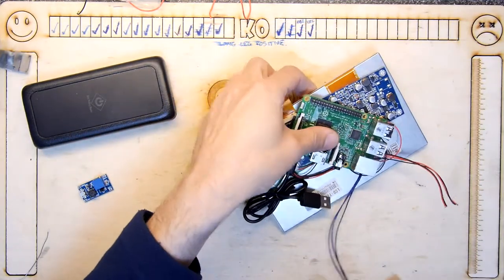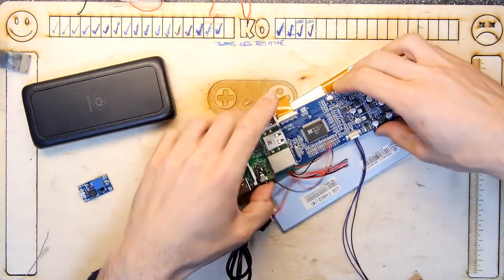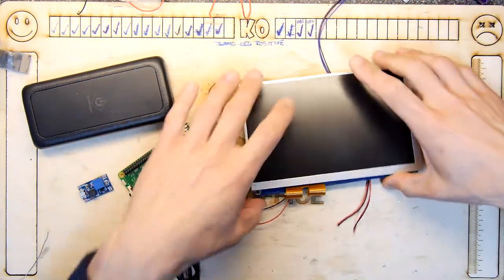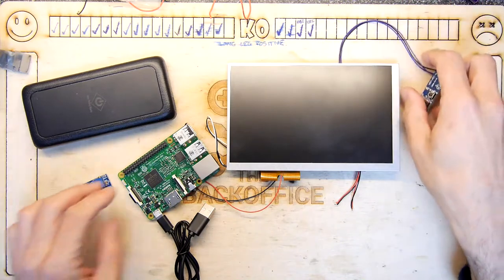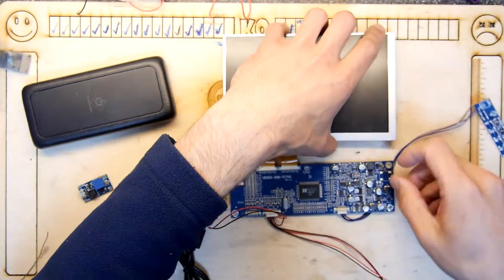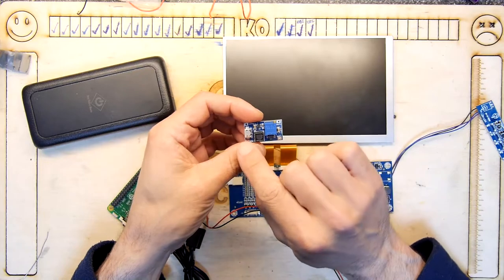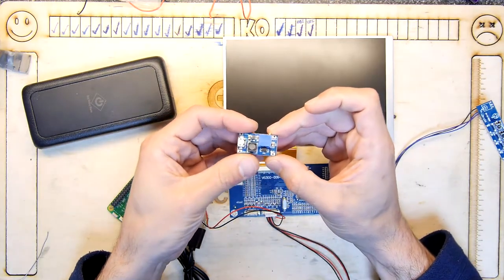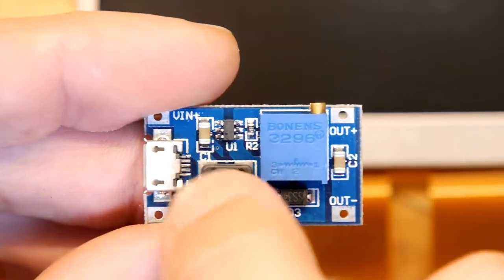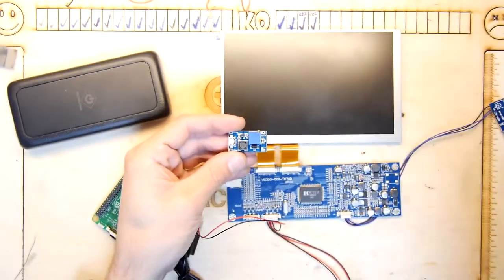Yes, that's my Raspberry Pi PCB gadget thing. If you recall, the problem I had was the panel requires 12 volts — it's a 12-volt panel — and although the data side works fine, the backlight didn't work because it was not receiving enough juice. But now, technically with this, I can achieve more juice because this should be taking 5 volts in and outputting a very much higher voltage by adjusting this pot. There's a little boost chip and its inductor.